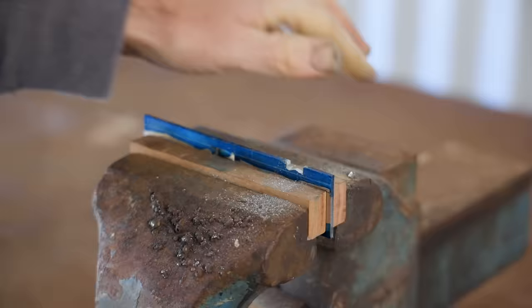I put a drill with a cutting end in the chuck, brought that down into a vise and then clamped that to the table. And then I put the bolt in the chuck. This drilled it perfectly in the center. I also realized that the screw would have snapped when I came to knurl it, being so thin. So I knurled the head now using my knurling jig before soldering it on to the new adjustment screw.